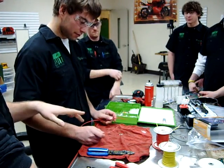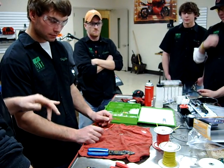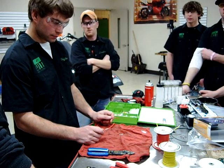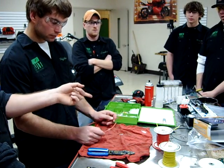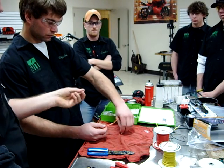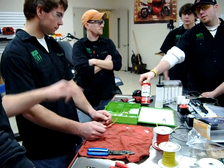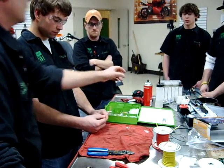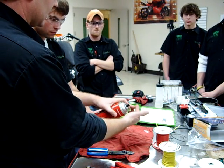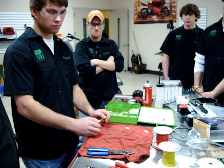There's intent in the way we did that. It's just that sometimes we talk about this in class about adjusting our technique. Why do we really not want to use WD-40? Just to let it degrade the wire. WD-40 is a great lubricant, but the problem is we're dealing with electrical — is that really what we want? Something that is putting a petroleum-based product around electrical? You could use brake cleaner — it gets super dry — but it would be okay to clean it, not ideal.